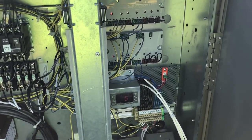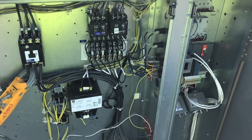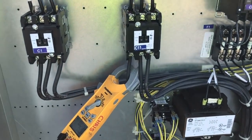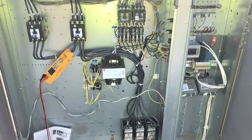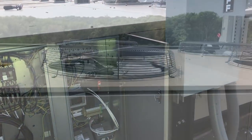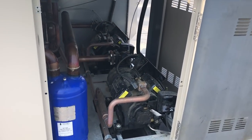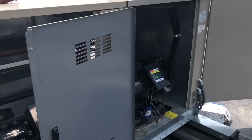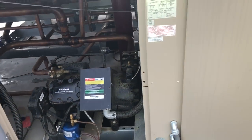After that it started up just fine. Always check this stuff guys, because you will always find something from the factory. Make sure everything is tight — we've got 460 volt, 75 amp contactors here. You want to make sure everything is safe because if not you're going to get really hurt, if not killed. Quick shot but she's all running — this thing is loud, running like a top. I'll be back Monday to start the other one; I only had enough refrigerant for this one.